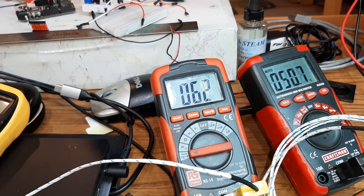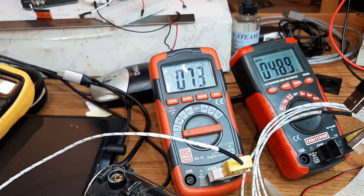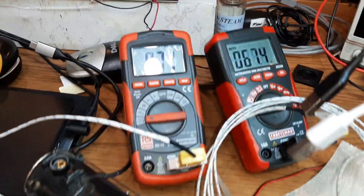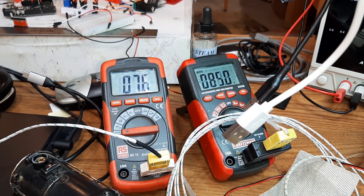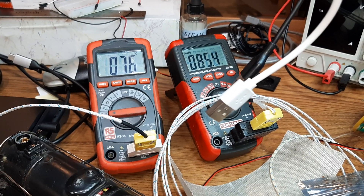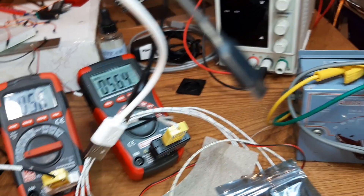Let's stick this in there and see what we get. It's at 50, 60, 70, 80. Let's see if we get comparable readings — 74, 76, 80, 81. The one on the right is a lot more responsive, I'm not sure why. So the rectifiers are now heaters. The transistors are cool — that is amazing. So the rectifiers are the source of the heat.